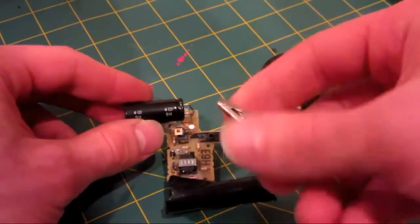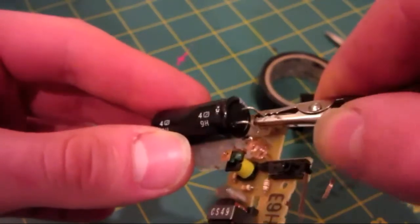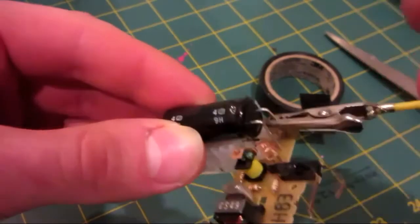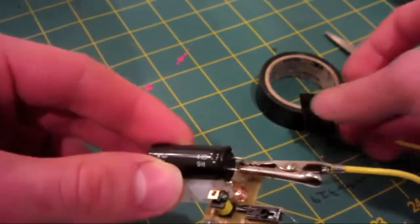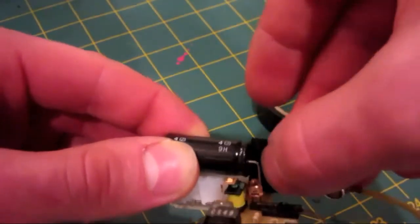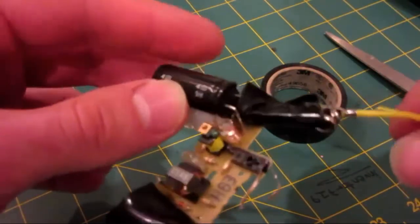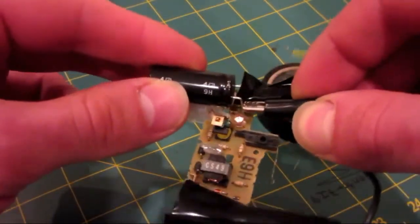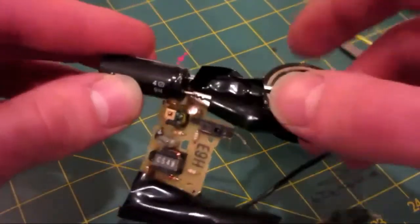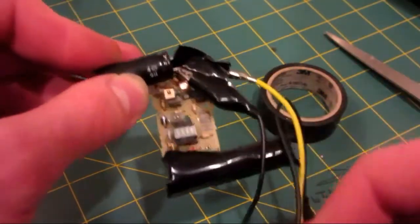What we're going to be doing is adding some wires to each side of the terminal on the capacitor. I'm going to just clip on the first alligator clip there. But so we don't accidentally bridge inside the tic-tac container, I cut off just a little square of electrical tape. I'm going to put it in between the two posts and wrap it around the alligator clip just like that. Then when I connect the other one, they have no way of touching.